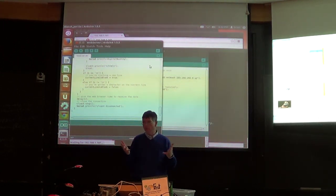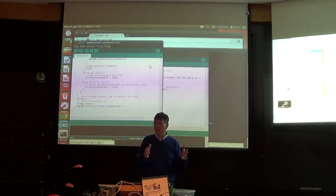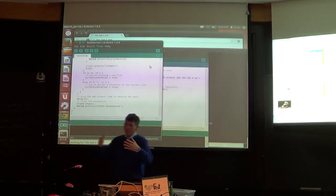So what I'll do between now and the Internet of Things Festival is, what I want to do is I want to put Dart on it, which is this thing that Google's been working on. And I actually got it running on the BeagleBone. I had to compile the tool chain stuff and all that to ARM, and it worked. And it worked well. But on this, I actually don't even have to recompile it, I don't think, theoretically. Well, I should. It depends if the existing binary expects something greater than a Pentium instruction. That's right. Right. So that's where it will get interesting.